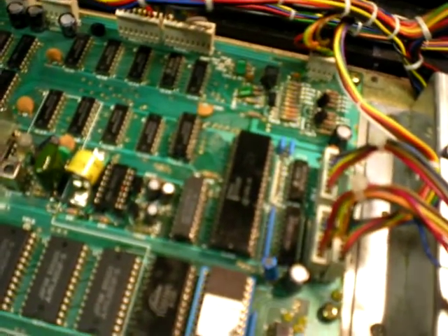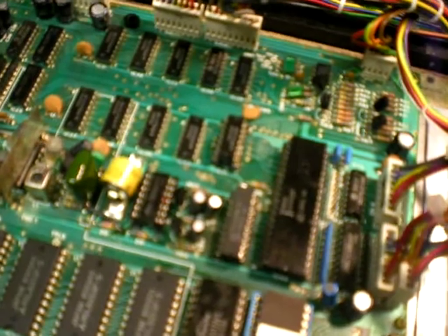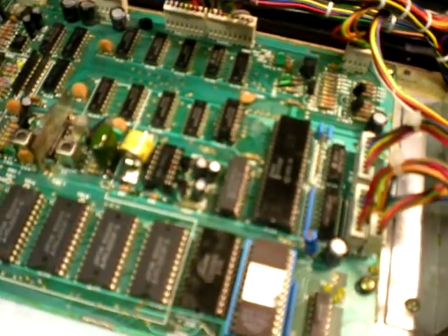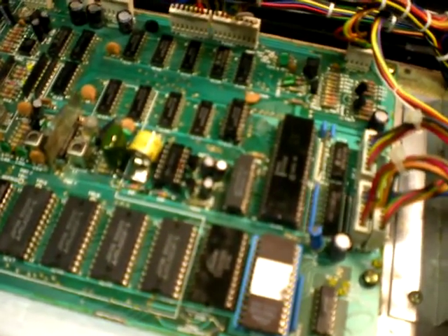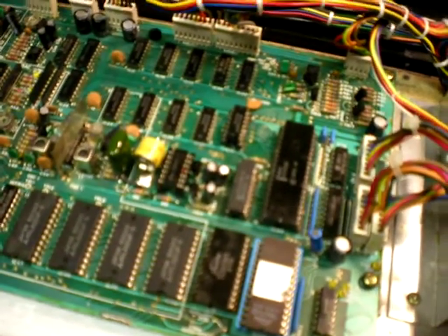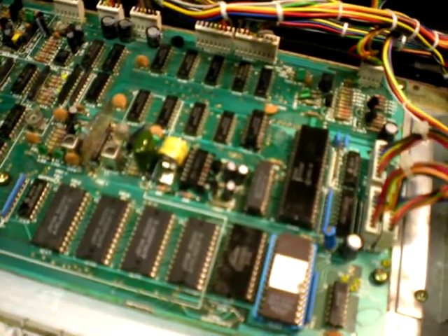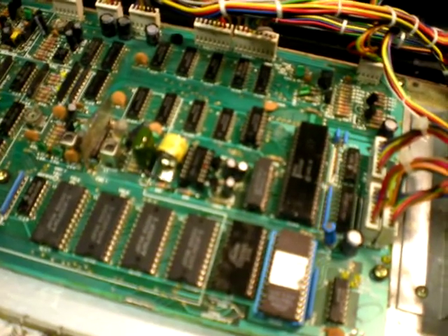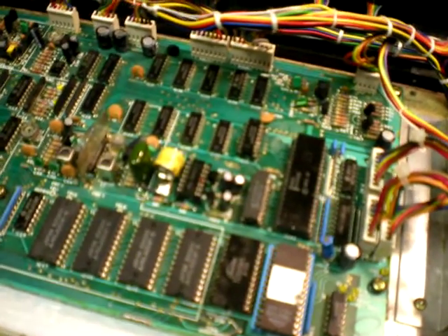That's non-volatile IC42. I added a little capacitor here, as you can see, and I advise doing that — a .22 microfarad or something. That will help kill noise. There is no filtering on the other side of that diode that bleeds down from the 5-volt, and it tends to have noise there when you scope it. I just thought, might as well smooth that out and lessen the likelihood of some pulse causing an issue.